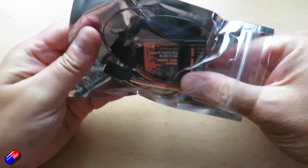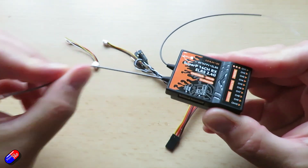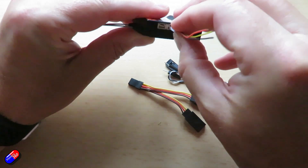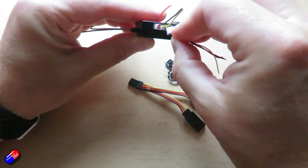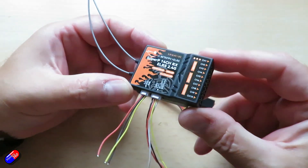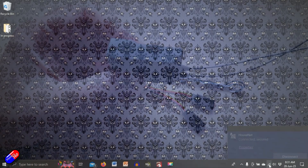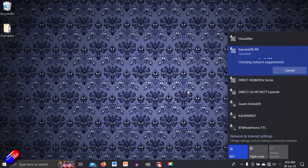This comes with lots of cables already in the package, including a Y-lead, leads for the side pieces, and a lead you can use to connect to your battery to monitor the VBAT. The RGB indicator has been updated to a new multi-color style: flashing rainbow means powering on, slow green flash means Wi-Fi upgrade, red quick flash means no RF chip detected, orange double flash is binding mode — making it much easier to figure out what's going on.